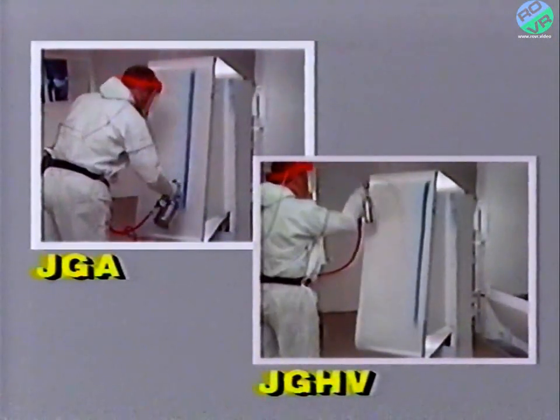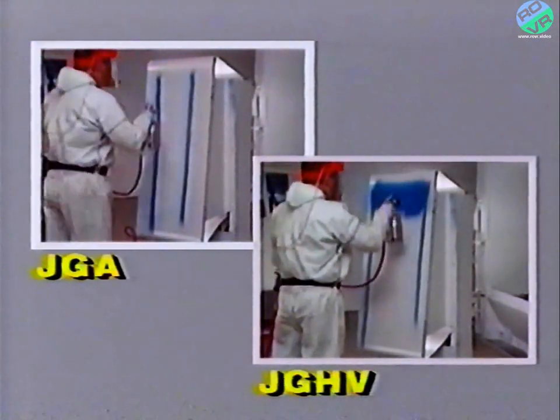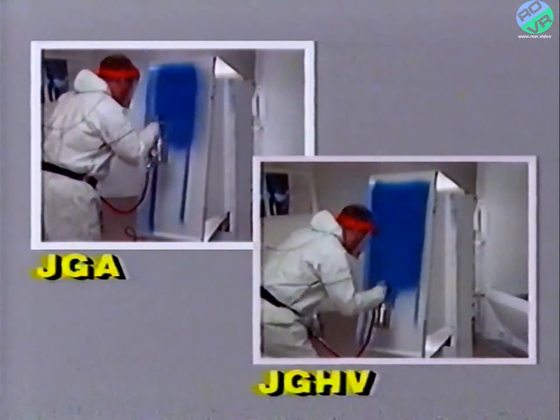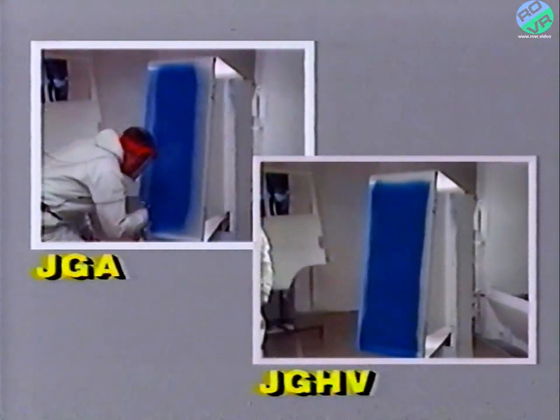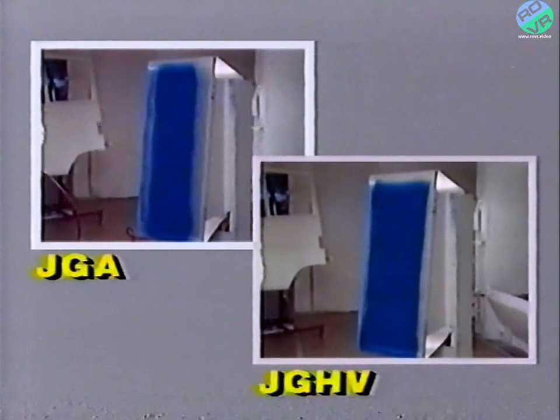Finally, we spray the paper from top to bottom, triggering the gun well within the width to avoid enforced overspray. Whilst watching the application speed, note the amount of paint on the paper outside of our boundary lines, and the spray fog at the sides of the roller machine as it's pulled away by our water wash side extraction booth.